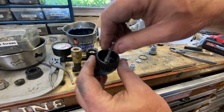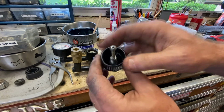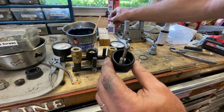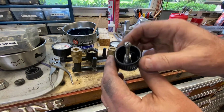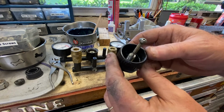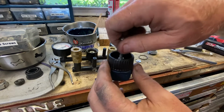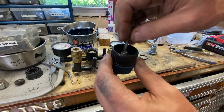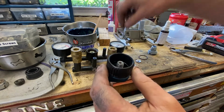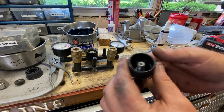I took that same M5 screw I used before to take it out, and I pressed it in the vise, and it's super tight. Then I backfilled it with some of this special glue from my kit that you saw in the VFR repair, the plastics repair. You can use any super glue. It's not going to work 100% anyway. This is probably some sort of nylon, which that stuff isn't really rated for, nor is super glue, but it's really tight in there. And if we put some leverage on it, you can see that it ain't going anywhere. With that knurl, it's got a tooth, so you just kind of have to play with it or make a new knob. That's all there is to it.